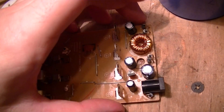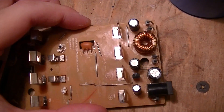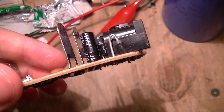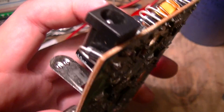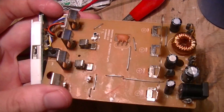There are a number of parallel-wired high-speed rectifiers, probably Schottky. Then there's an anti-reverse polarity protection diode right next to the barrel connector — that's one and exactly one thing this charger has going for it.